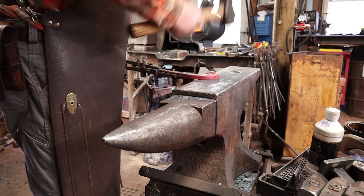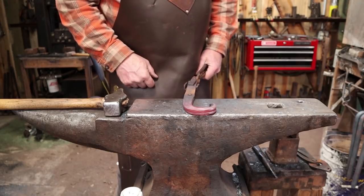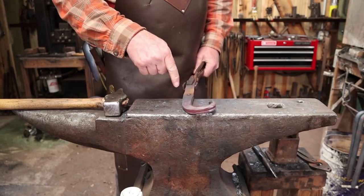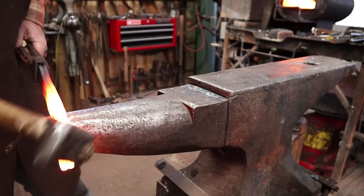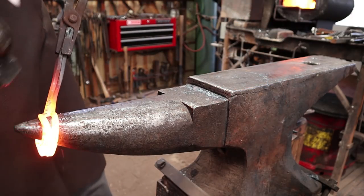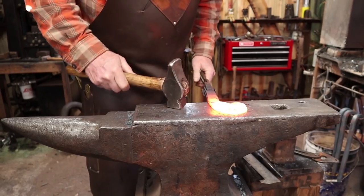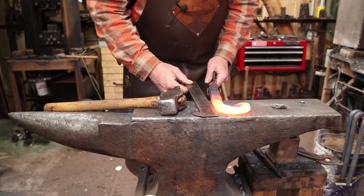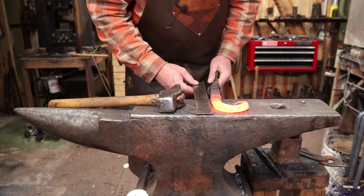Now another thing that's important is how tall is the rafter. This is going to bump into the underside of the roof decking before my hole is up where the bolt can go. So I need to scroll this up far enough that my hole is actually on the rafter where it will do me some good. Of course there's nothing special about these scrolls I'm doing — they're just for the sake of doing something. So that's at about 4 inches which would work, but I think I'm going to scroll it up just a little bit further.